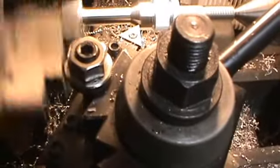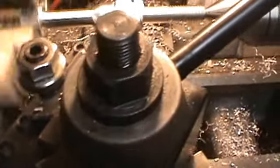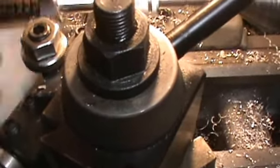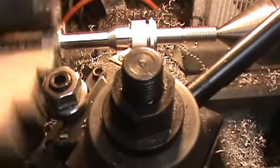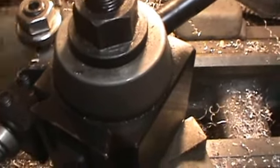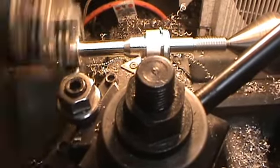I'm using a different tool now to cut this off. I've got the automatic speed set. I'm taking about 15 thousandths — that's 30 thousandths total — 15 thousandths per side. That's pretty nice. I'll just continue working this down until I've got the bolt at the correct diameter.